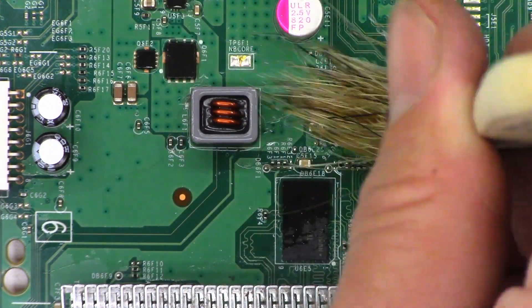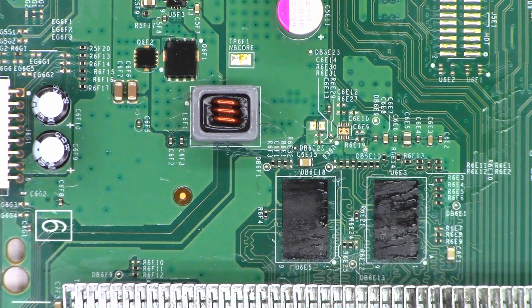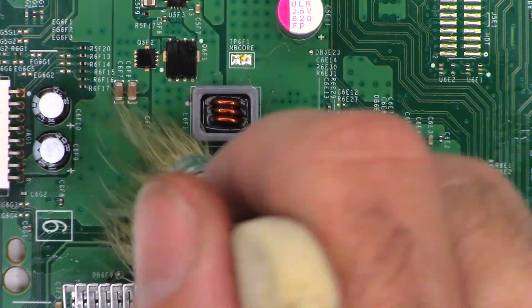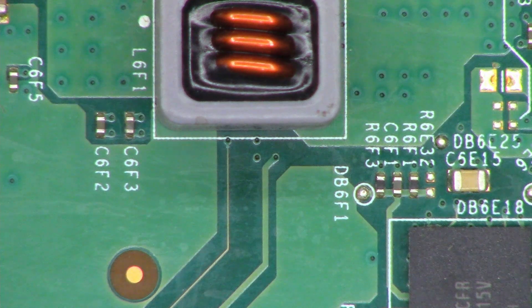I've even looked over the power supply and it looks just fine. I've dried the paint brush and I'm just going to use it to wick some of the water up. I'll just do this two or three times, then take some compressed air and blow the little paint brush particles off the board. And I think we'll be fine. We'll plug it in and see if it even turns on. After cleaning, I don't see any significant damage whatsoever. Even the conformal coating of the circuit board has not been damaged in any way, so I don't believe that was the issue in the first place.